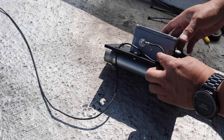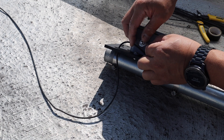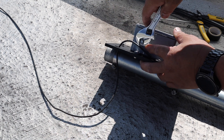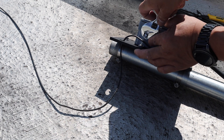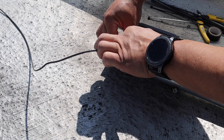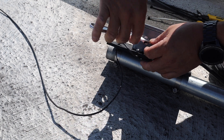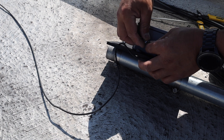I'm doing this to relieve tension. If I didn't do this, the solder joint would weaken — with the wind blowing back and forth it would loosen and eventually snap off. I was on 10 meters FT8 about 30 minutes ago and wanted to test this. For the 4-to-1 balun I was putting about 500 watts out on FT8 on 10 meters. Now I'm going to figure out the best position for this, because the strain relief is going to be above this location.